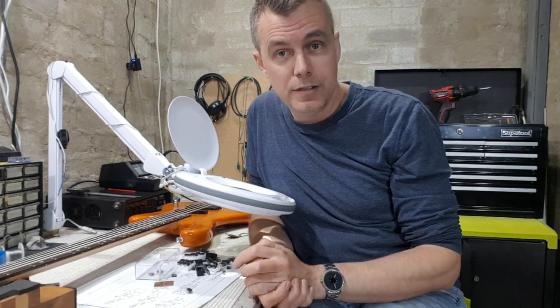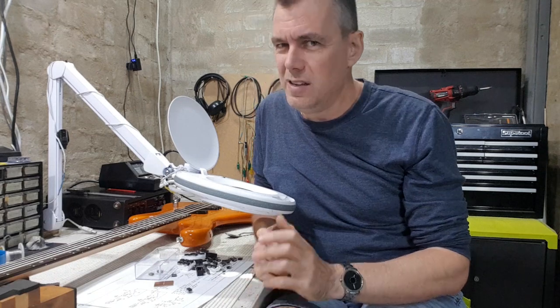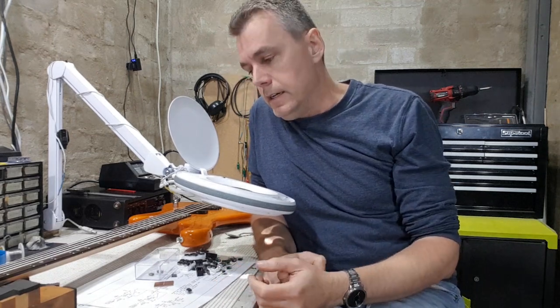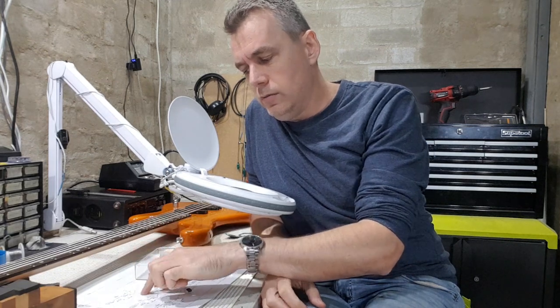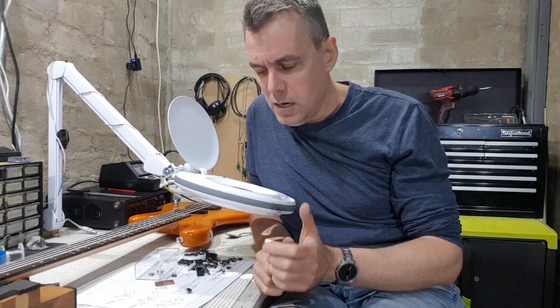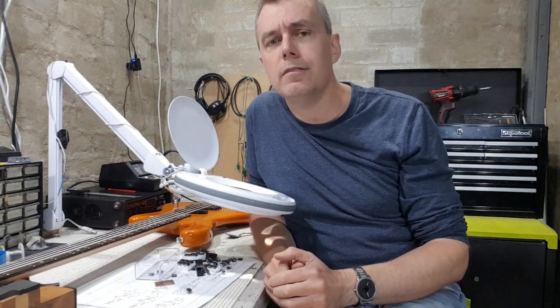So I guess the next step is to gather up all the parts, and I think the first thing you should find is the IC, the chip, the dual op amp. And there's hundreds you can use. I think I've listed 4 or 5 on the circuit itself. With a circuit like this, where you're running little or no gain and a moderate input impedance, honestly, a TL062 will work just fine, and you'll get great battery life as well.